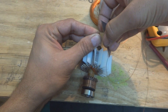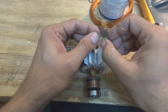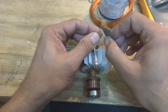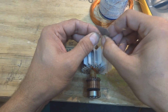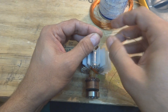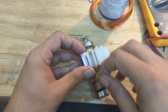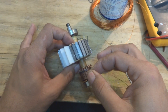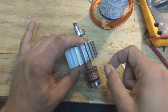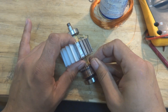I have to remove this coating so that it will make contact with the commutator. The first one did not make it yet — I will do it later on, that's not difficult because it's not in the midway, it can be done later. But this was important since it was coming in the midway. So it's like that, and then of course we have to wind it the same way and bring it to the second starting point.